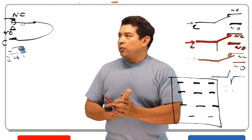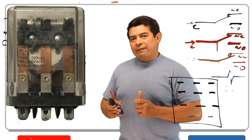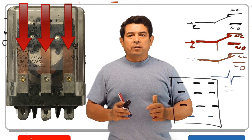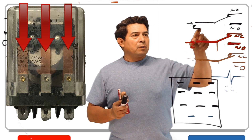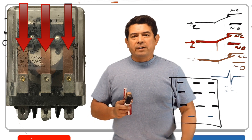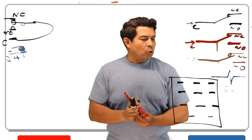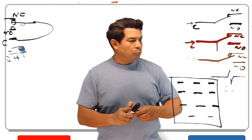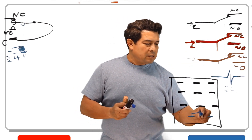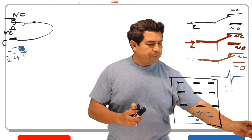When we look at this other picture of the relay, we see that we have three different circuits, just like here — one, two, three different circuits. Now if we wanted to, we could run 24 volts through this one, 110 through this one, and 220 volts through that one. When we put 24 volts to the coil, the coil will energize and it will pull all of these down. So our coil is going to be basically right here — that would be the 24-volt connection right there.